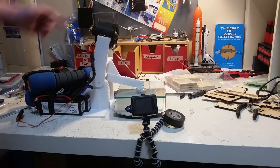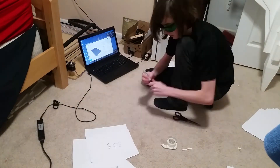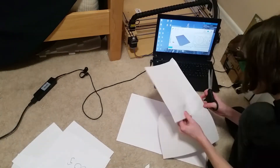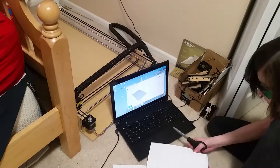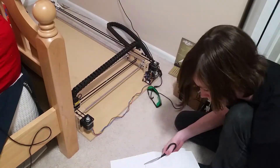The next thing we have to do is try different exhaust diameters. I designed the geometry of the thrust tubes in Google SketchUp, then imported them to Inkscape where I generated the laser G-code for them. They are cut out from two sheets of A4 paper that have been taped together at the edges, and that provides enough area for the thrust tube to fit on the paper.